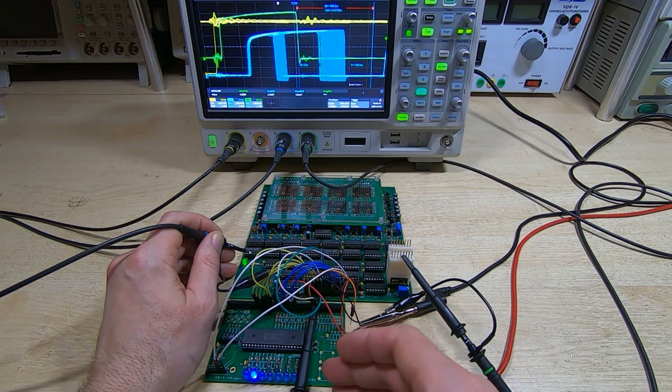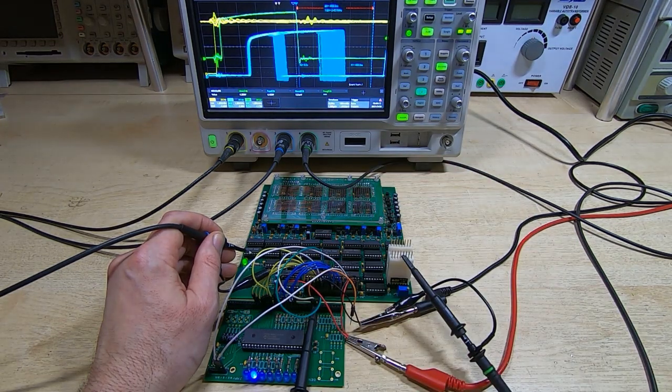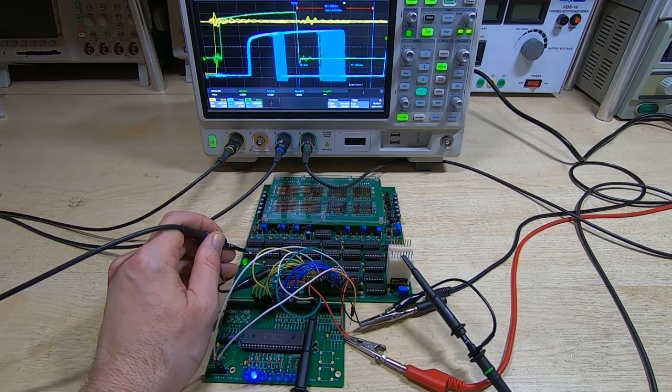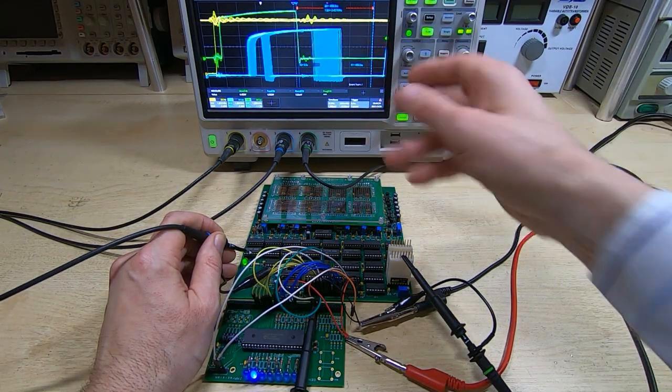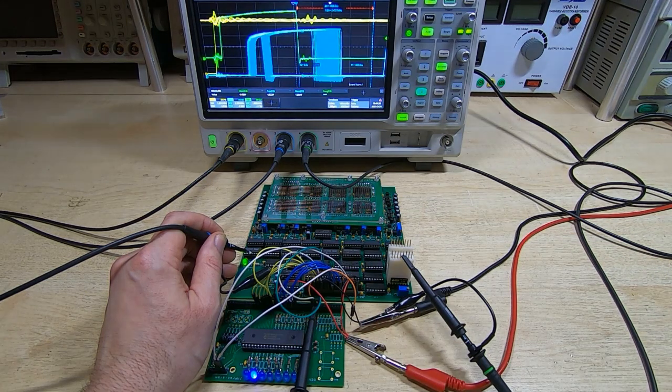The reason we were getting errors on this channel is because, as you saw, I adjusted the channel and it was incorrect. If we now go back to the voltage that we had previously, okay, you can see that even though the voltage has now gone up by 5%, this is still working fine, and we're not getting any errors showing in the system.